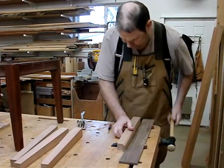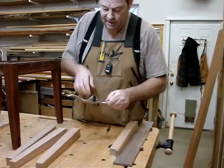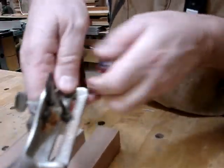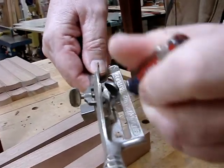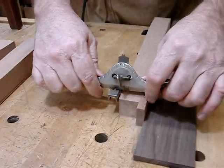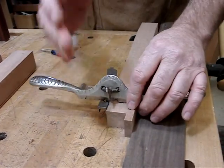Important with beading — come in close here — is what happens is this little shaving gets curled up and gets all tangled up in here, and so this is called being foul mouth, because the mouth of the beader gets fouled up. So you have to clean that, because it's very important that this shoe rests firmly on this side, because if it doesn't, your bead is crooked.